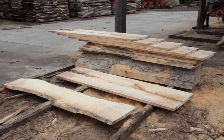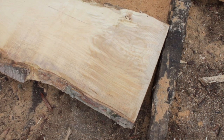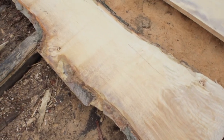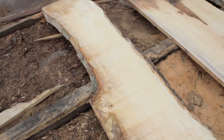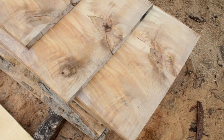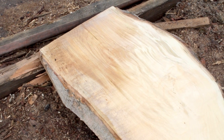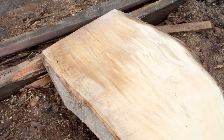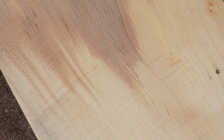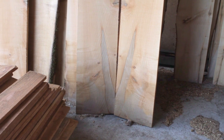Here are some more boards that have just been cut. You'll notice some staining encroaching in from the ends of these boards. This is caused by fungal growth attracted to the sugars in the sap, and this is why sycamore should be cut down only in the winter months when the sap flow is low. In Scotland, this is considered to be from November through to January. Any later than that and it's likely that the sap will have begun to rise again, so staining will be a problem, and that pristine creamy whiteness typical of fresh-cut sycamore will be lost. This doesn't necessarily make it an undesirable board — it can still be attractive — but as a supplier of kiln-dried hardwoods at Scottish Wood, we wouldn't want too many boards with stain.